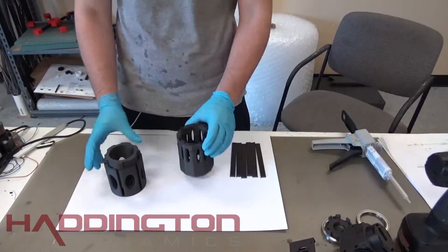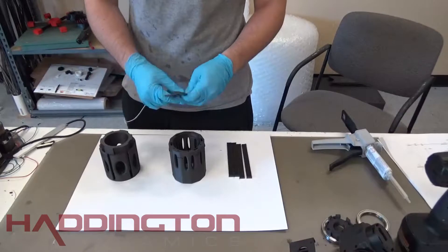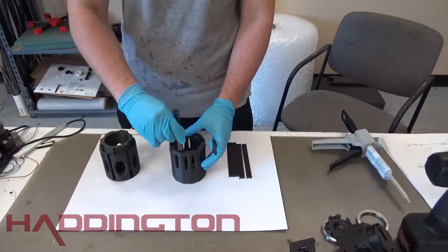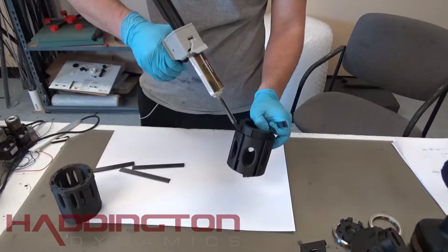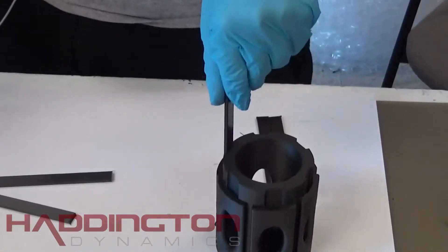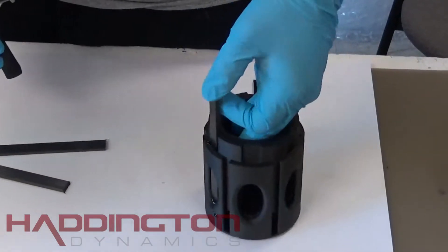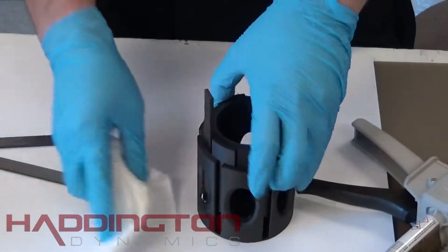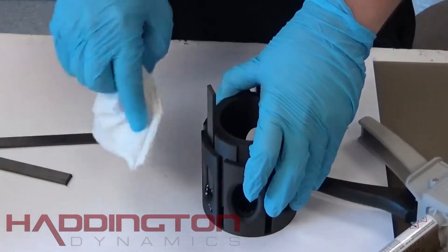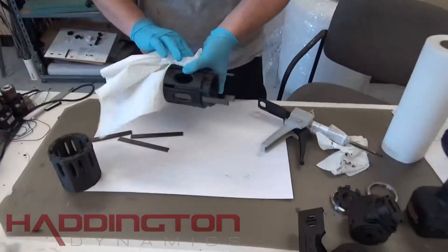While those are drying, we're going to glue the 6 133mm carbon fiber strakes into the base light and the base mount. Each part will get 3 strakes evenly spaced apart. Put some epoxy into one of the strake holes at the top of the base mount and the one immediately below it as well. Then slide a strake in, lightly thrusting in and out to ensure an even spread of epoxy. Wipe it down and try to keep everything as clean as possible as you go, especially the top as a clamp will go there. Repeat this twice, skipping a hole in between each strake.